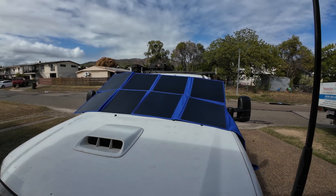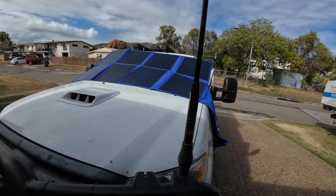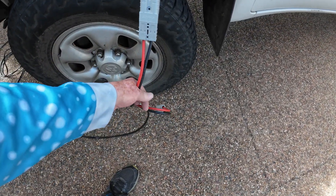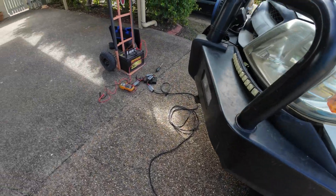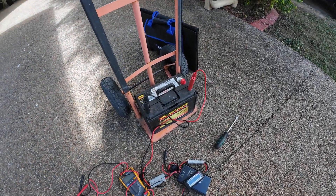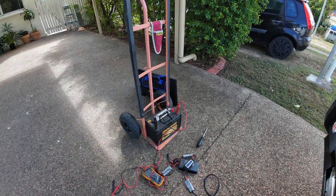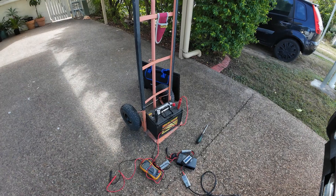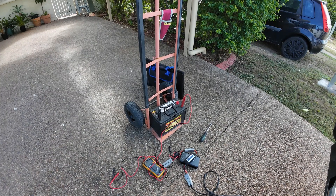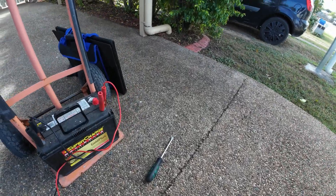I've got it laid out on the windscreen which fits perfectly. It's about 10 o'clock in wintertime in North Queensland. I've got it plugged down through a Y-piece — I'm going to add another solar panel soon — down through a waterproof MPPT controller, down to a battery, through a watt meter. This battery is pretty flat, only 3 volts. I'm going to try and see if it brings it up, and if not I'll try another battery. It says it's not putting any current but there is voltage going into the battery.